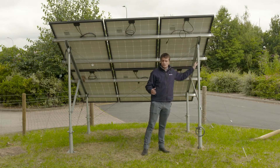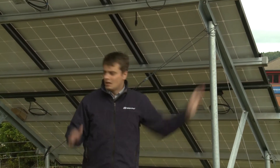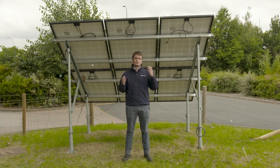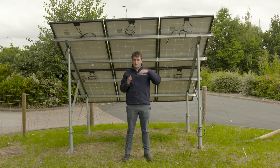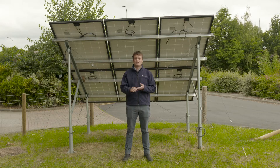As we've said in a previous webinar, we are engineers — we understand bracing and have vast experience in the seismic industry, and we're now applying that to solar. Essentially, what we're trying to do is share moments across the frame. Your moment is your force times your length. By using a brace, the force applied here is transferred down the bracing system and applied to the pile down here, which means there is a lower length — so a smaller moment acting on that frame. We've managed to spread out where the moments are and reduce the reactions on that frame, meaning we can reduce the amount of steel in the frame itself.